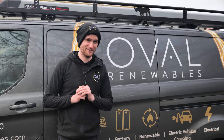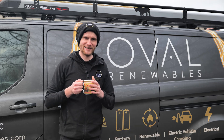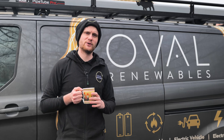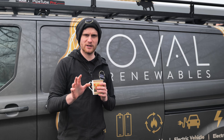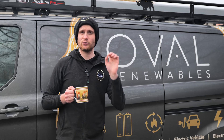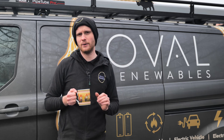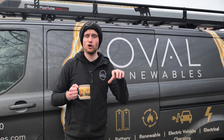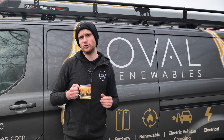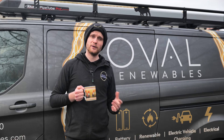So let's talk about paperwork. None of us like doing it, but with solar there is specific paperwork that needs to be done. We've got a G98 application and a G99 application. The G98 is a retrospective notification — if we're fitting a 3.68 kilowatt or below inverter, regardless of how many panels, we can fit the system and retrospectively notify the local DNO. For us here around York, that's Northern Power Grid, though it depends where you are in the country. It's a quick, easy process — we can roll up, fit the system, and notify the DNO afterwards.